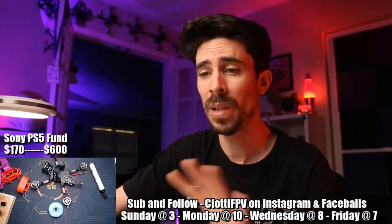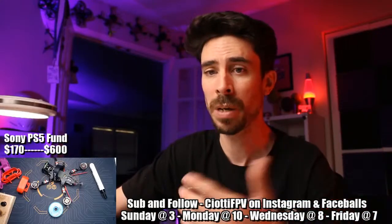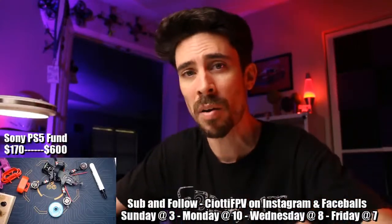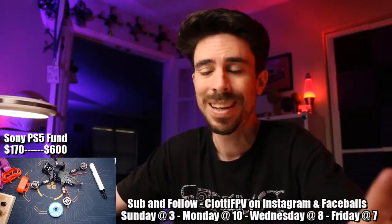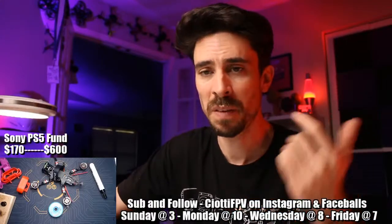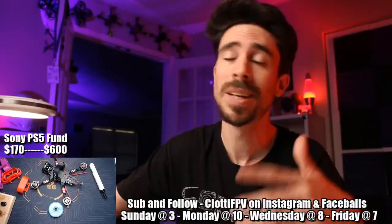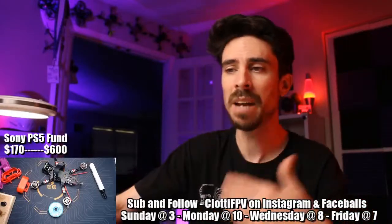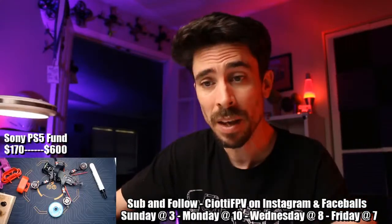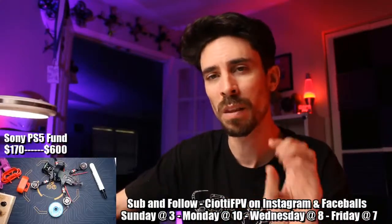And for the record, if you're only looking at bench test data for 100% throttle, it's completely worthless because, again, you spend very little time at 100% throttle. So stop looking at full throttle amounts of thrust. I guess it's a little bit important, because when you're at full throttle, if the powertrain is going to make 2,000 grams of thrust versus 5,000 grams of thrust, that's going to be totally different, right? And if 5,000 grams of thrust leaves you with a thrust to weight ratio of like 30 to 1, that's going to be a pretty impossible rig to fly. That's way too much. You want to be closer to like 10 to 1 thrust to weight ratio.